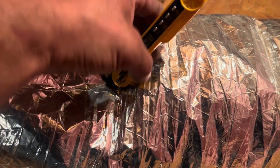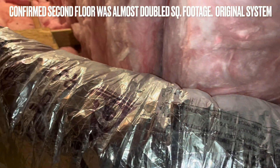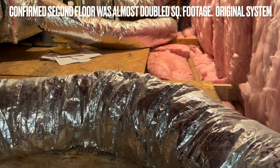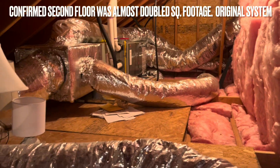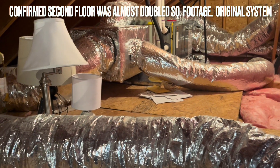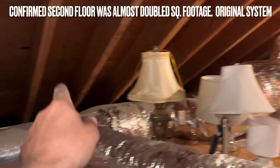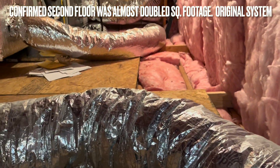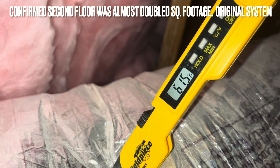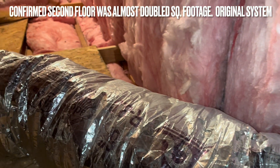I had a couple of vents closed — a couple of the dampers were closed, two over there. Let's see what we get over here with this long flex. Low on charge, but I don't mess with refrigerant where I'm just going to dump it in for an undersized system. I don't know the square footage up here. All I know is it's taking in a high heat load — you have duct board, flex, round duct, and all this extra nonsense which goes everywhere. Hackery at its best. 61 and a half — you're at 75 downstairs at your return.